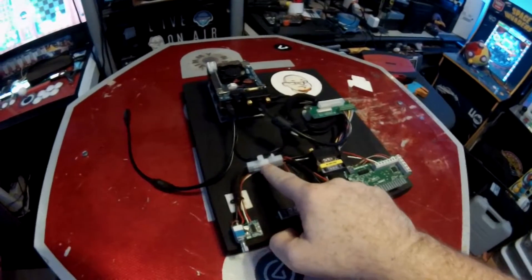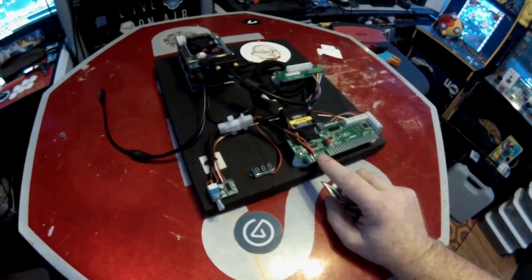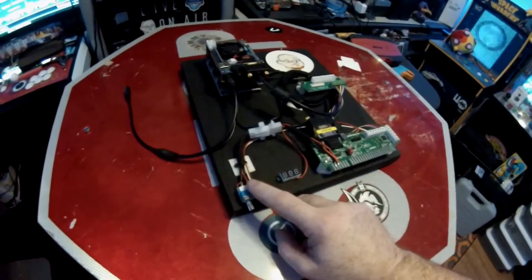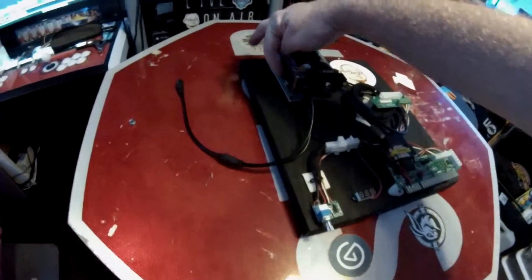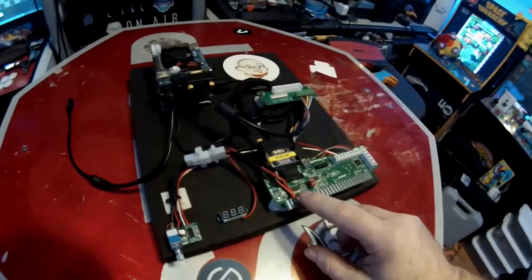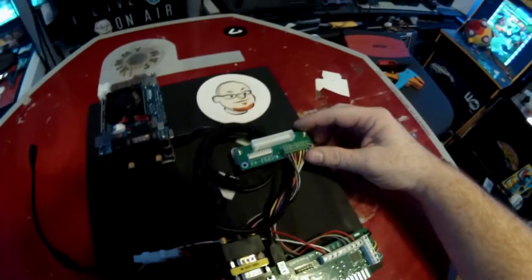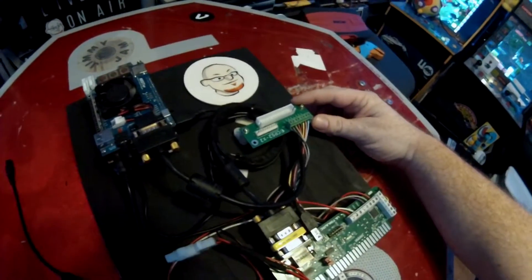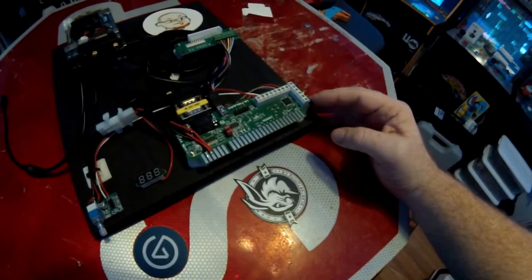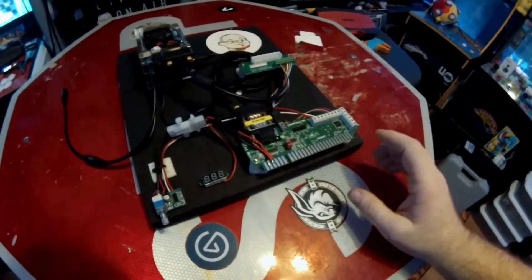Then I have the 5 volt again from here — I have it in a little connector coming off the JAMMA edge. I also have a volt meter here just to make sure everything's okay. When this is being used in the cab, not much is being pulled from the 5 volt or 12 volt. You can also power the amp off of the USB plugs — they make little breakout USB adapters for that. The JAMMA edge of my cab is only set up for three buttons, joystick, start, and all that. So I used this little JNX CPS2 adapter — I have my kicks wired up for that, coming off here and going into the JPAC. This should work with all the CPS1 stuff, all the 4-button Neo Geo, all that.